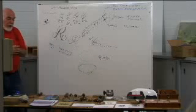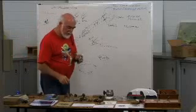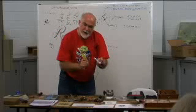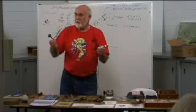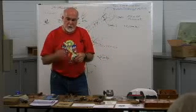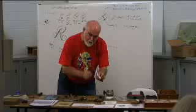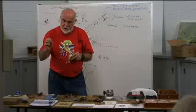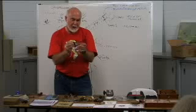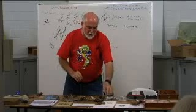I've never done this, but in America, gun engraving is very, very popular. And that's where they use these larger blades, because often the gun engraving is done with a little hammer and the blade itself, and they actually hammer because they're having to carve through the steel of a Colt 45 or a Winchester repeating rifle or something, and the steel around the bolt action of a rifle is very, very hard. So they use the high-speed steel, and they do all their engraving by hammering. Or nowadays they're often using the compressed air type tool, where you have a little tube coming up into the handle with a little hammer inside the handle, which is hammering along the length of the blade and driving the blade easily through the hardest of materials.